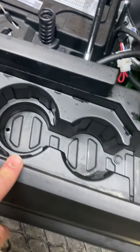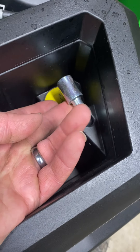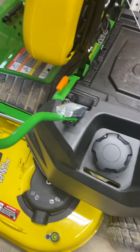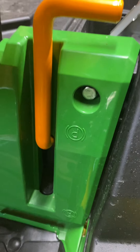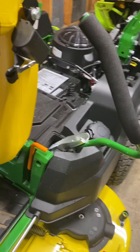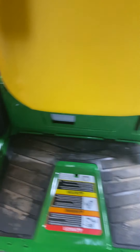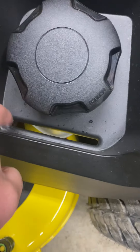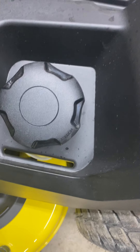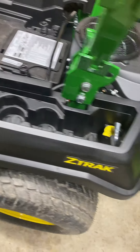It's got plenty of storage spots and cup holders. Here's where you adjust your hydraulic motors for tracking — you go right here and that would adjust your tracking if you're going too far left or right. You adjust either side there to help with that. There's a huge fuel cap here, and it's got a little drain so if you spill it just runs onto the deck and then the ground, rather than sitting all over everything.